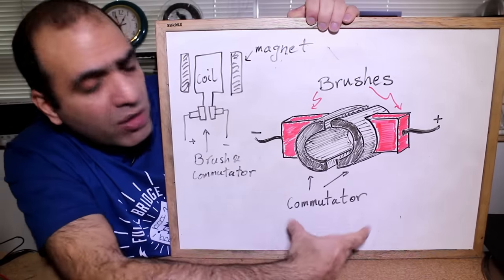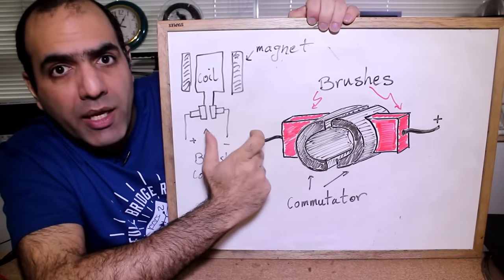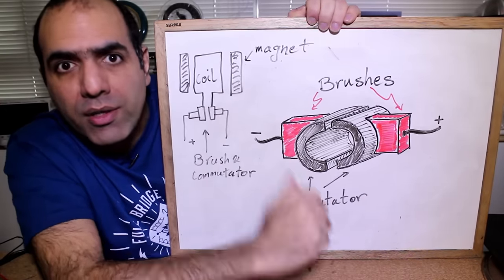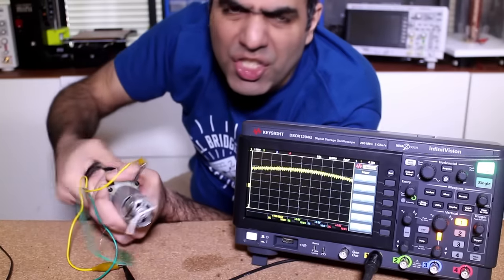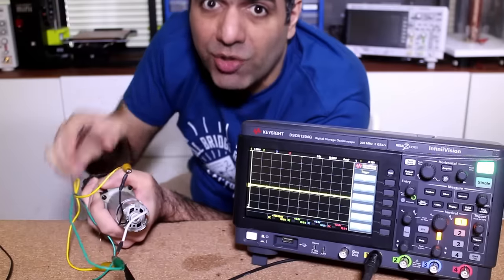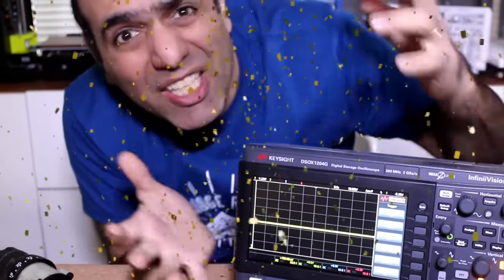There are a bunch of challenges driving any motor, typically at startup, shutdown, and during operation. A lot of what I'll say applies to all electric motors. The commutator is an interesting arrangement — it converts the DC input to AC over the coil because as the rotor turns it flips the polarity over the coil. If we turn the motor manually, we generate electricity simply because we are moving the rotor coils through magnetic fields. This generates AC over the coils at around 100 Hz, but the commutator rectifies it at the input.